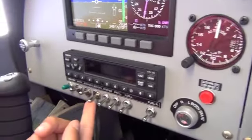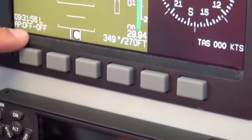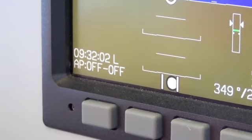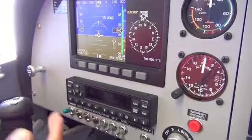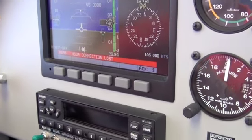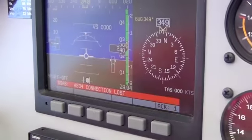Pretty much that means our Autopilot switch is off and disarmed. Down here is the Autopilot switch. When we flip it on, it's going to say off and off — so now our Autopilot is armed but off, and we're not getting any heading or altitude guidance. It's important that if we're going to use the Autopilot during a flight, we turn the switch on while we're on the ground.